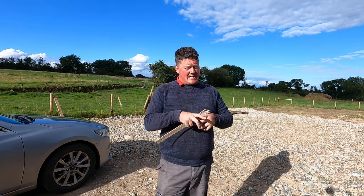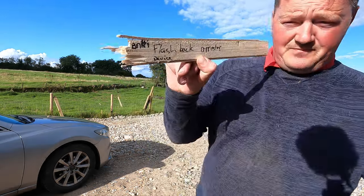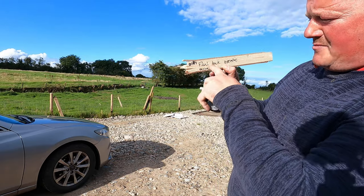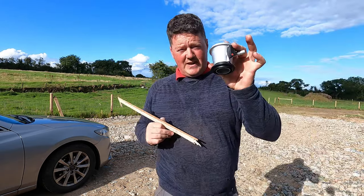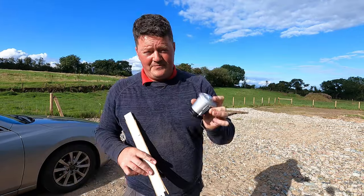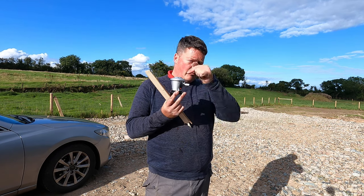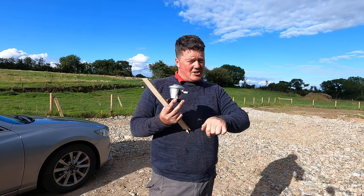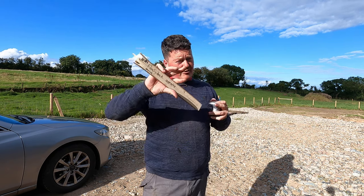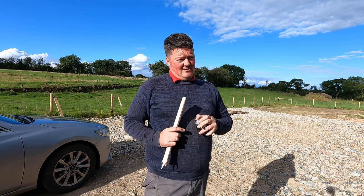But Connell assured me that the risk of exploding the tank would be pretty high — not worth the risk. So this is what I wrote this down for: a flashback arrestor device, an anti-flashback device. Without this, at a low flame, it could have gone back up the pipe into the cylinder and kaboom. I would far rather be arrested than blown to bits. Think about it before you buy.